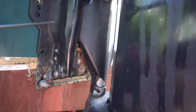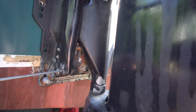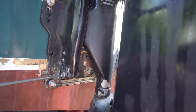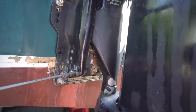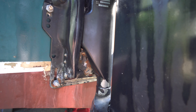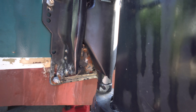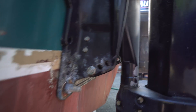This is why I'm suspecting this is an aftermarket unit, because there is no way to reach this screw. I've read online that some people managed to turn it at an odd angle because it doesn't actually align with this hole. I actually took this whole assembly apart and the screw also had a ring around it, so even if you were able to turn it, the ring would still prevent it from being turned correctly. I removed the ring and tested it, but when I put it back I still cannot reach it with a screwdriver. I think the best workaround would probably be to drill a little hole or enlarge this hole just a little bit so that you could reach it. For a while I wasn't sure how the manual release operated on this motor, as it's kind of hidden, and if it's not bright daylight, even if you look in this hole it's pretty hard to see it. But there is a little screw in there and that's where you're supposed to turn.